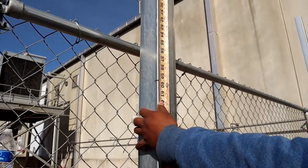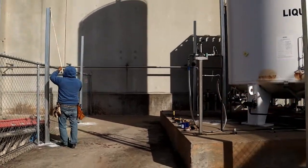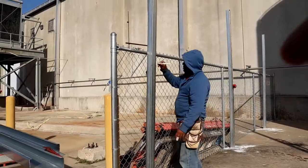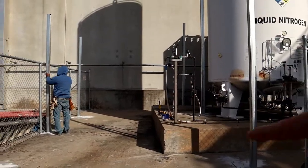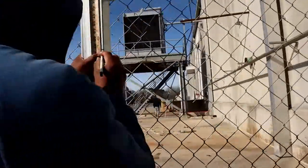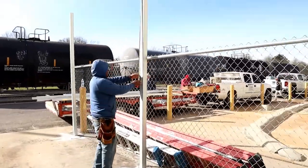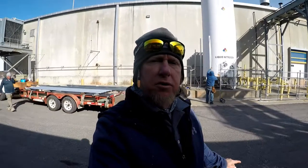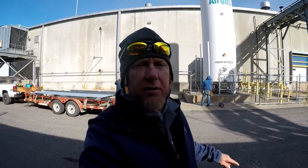Right here we've got 59 and 5/8 inches. We started with a 10-foot column, and when we set our first elevation we started with a 5-foot mark off the concrete, and it came out 59 and 5/8. So you can see the elevation of the concrete is about 3/8 off from the front column. This other column here we've got 61 and a half inches. So measuring from the top of the column down to our elevation mark, we've got 61 and a half, 60, and 59 and 5/8 — that tells me there's a 2-inch level difference in the foundation.